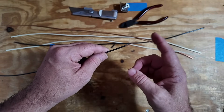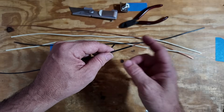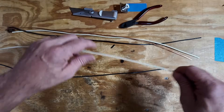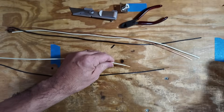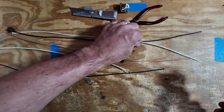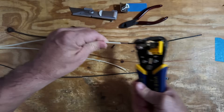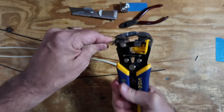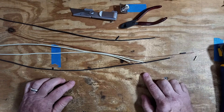If you didn't have those, you could just take a knife, score the insulation on the outside, and go ahead and pull that insulation off. That will work equally as well. And in fact, I want to see if we didn't do anything with checking the SWR — could we actually use this antenna just based on the calculation that we did in the very beginning of this video? We will check that when we get outside.